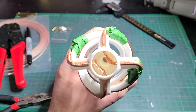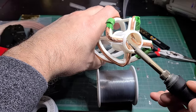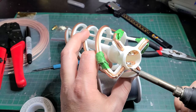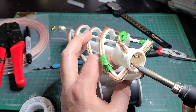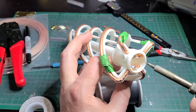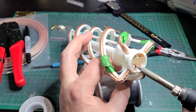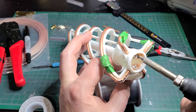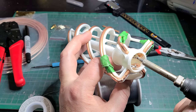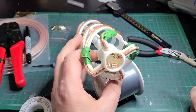Now soldering these two together. A little building trick: the soldering might look like Swiss cheese, but what I'm doing is heating up one section at a time until the solder flows, going back and forth, because copper is a very good heat conductor and heats up quickly — it will start melting the frame if you stay in one spot too long. Just hold it in place until you get a good solid flow of solder between the two. Use as much flux as you want to get a good electrically sound connection.